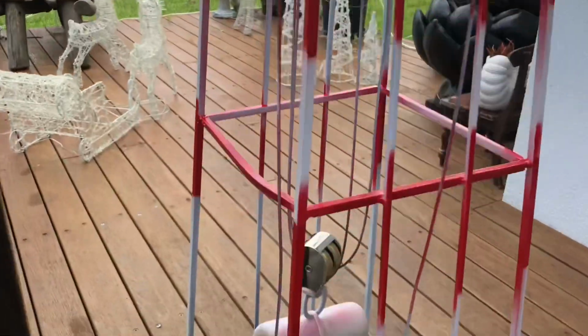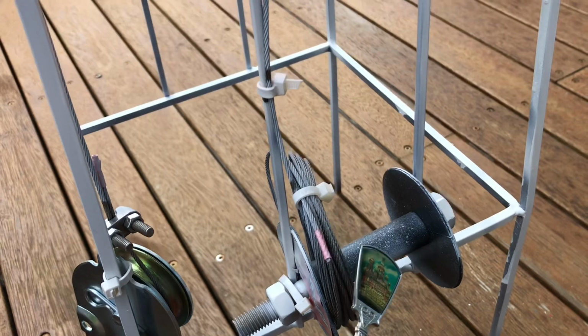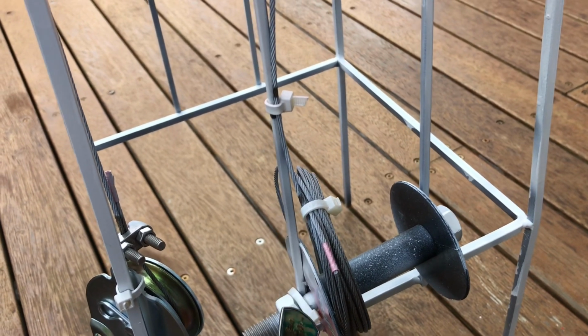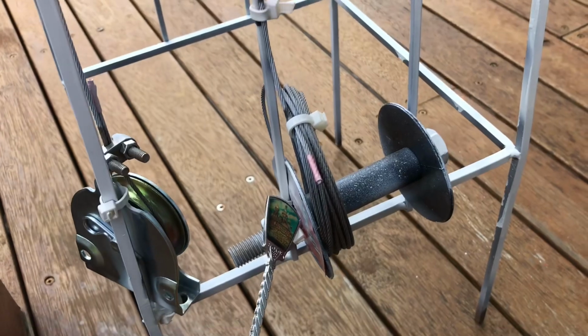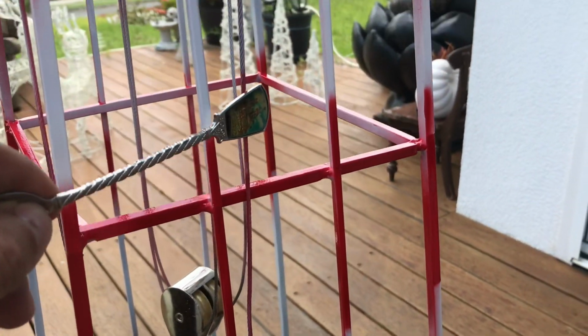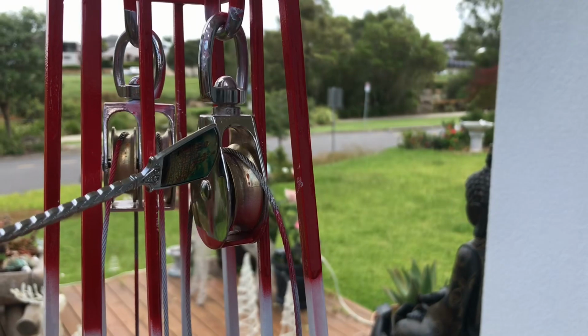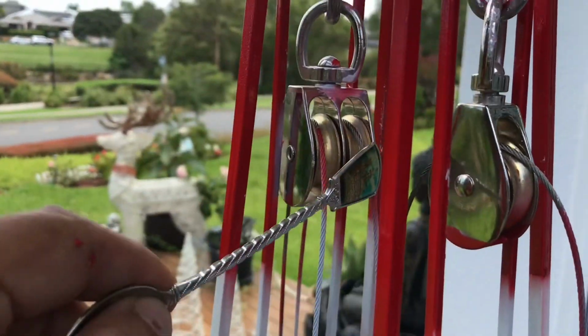Okay, let's start here. Your drawworks, which is this one, is clamped. The wire line is clamped with a clamp over here. Make sure the clamp is good enough, and then the wire line, the drilling line, runs all the way to the fast line. The wire line, which is 1 3/8, 1.5, doesn't matter, 1.25, depends on the horsepower of the rig, goes all the way up to the fast line. From the fast line it will come down all the way to the traveling block.